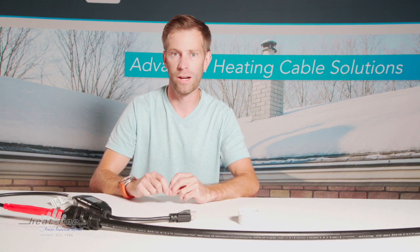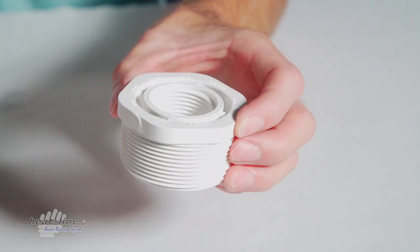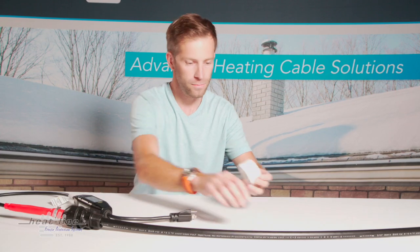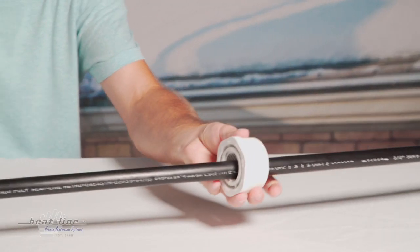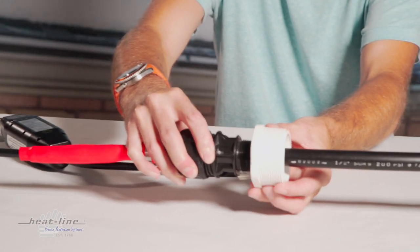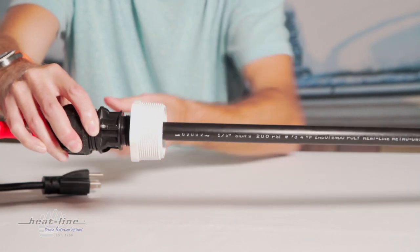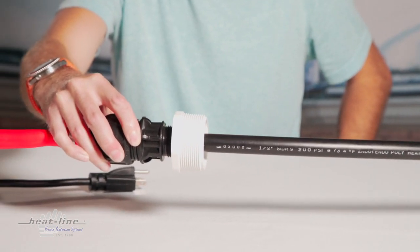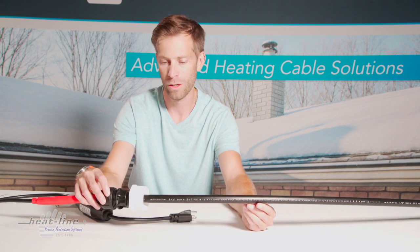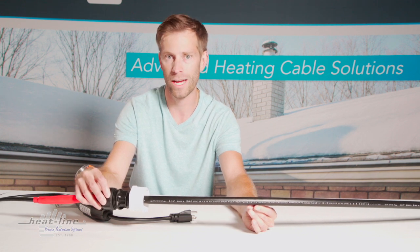Most of the time, this product is going to be found in a two-inch pipe. So in the package, we include a threaded bushing — it's a one-inch female to a two-inch male. By applying the threaded bushing and threading this on to the RetroFM fitting, we now increase from a one-inch thread to a two-inch thread. So if we have a two-inch T fitting incorporating a two-inch female thread, we have now just adapted it so that we can connect properly to that two-inch pipe.